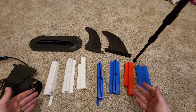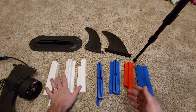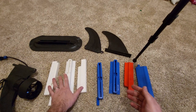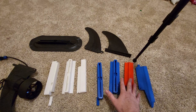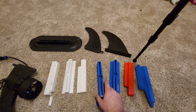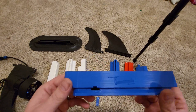We have four different types of adapters in two different materials. These three here are ABS plastic, made from an injection mold, so they're going to be a lot stronger, more heat resistant, and more durable. These others are 3D printed from PLA plastic. PLA has a lower thermal rating, so they can get hot and melt or warp a lot more easily.